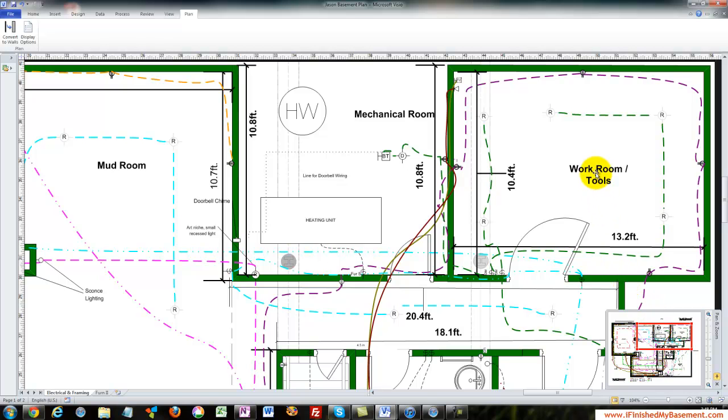Let's start over here in my workroom — this is a sample room. As you walk in the door, on the left you can see these dollar sign symbols, which are the switches. Visio puts a 'DM' next to a switch if it's going to be a dimmer switch. Each switch is hooked up to a line — you can see this dashed green line, and as you follow it around, it runs into a recessed can light. This particular switch is hooked up to three lights, and it's on a dimmer, so I can dim the lights in this whole part of the workroom.